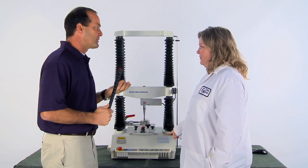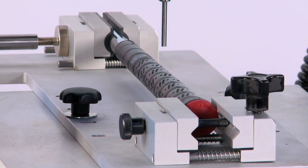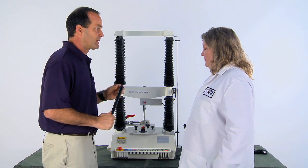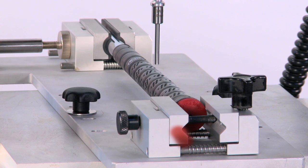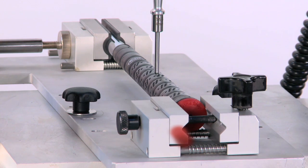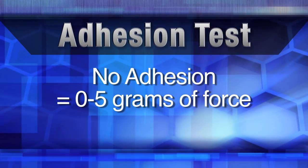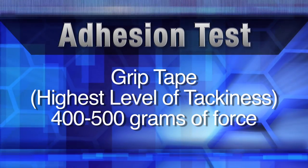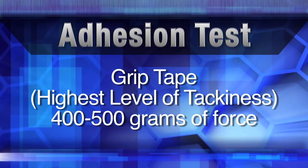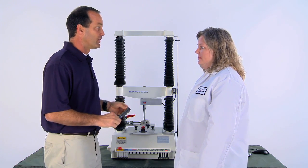Can we go through exactly what this test is? If you put something in here and it has no adhesion or no tackiness to it, what would happen? Basically, the machine puts the probe down on the sample that you're testing and as it pulls away, it measures the force that it takes to pull off of it. If there's no adhesion whatsoever, no tackiness, you're going to have zero to five grams of force. The grip tapes that you may use will have four to five hundred grams of force to pull away. So basically, the more force it takes for the probe to release from the material, the tackier the material is.